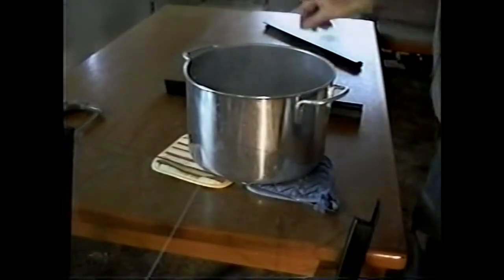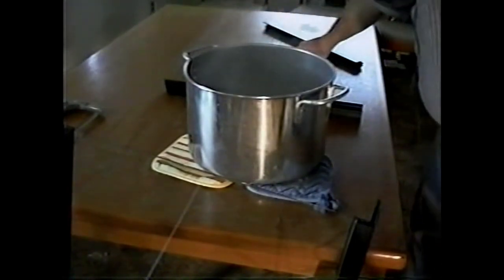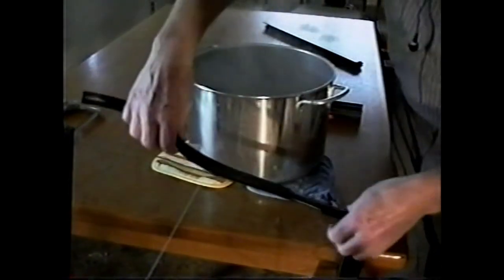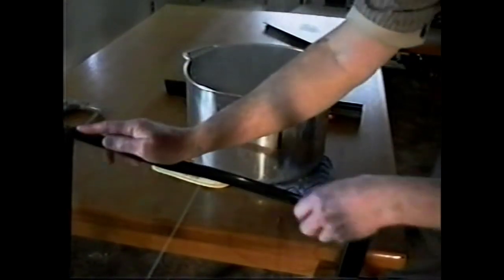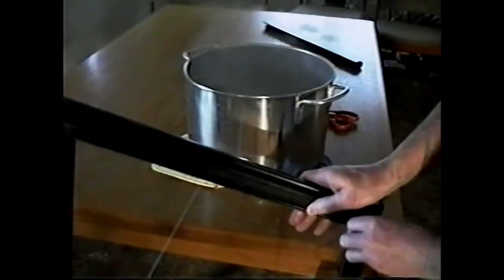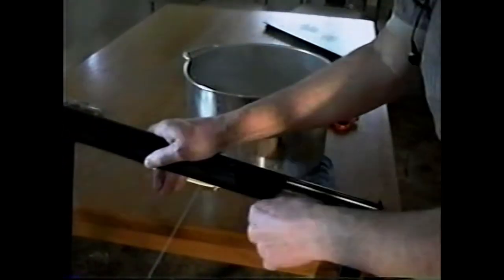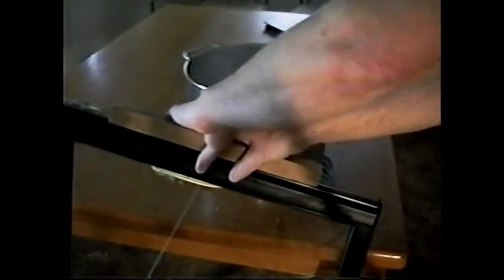The trick to putting the moldings on, or the glazing on the glass, is to heat the vinyl gasket material up to around 160, 180 degrees Fahrenheit, get it real soft. You put it in place. And you put the particular pre-cut molding in its place over it. And you drive it into position.